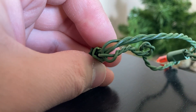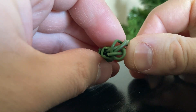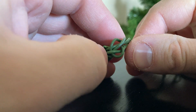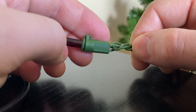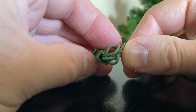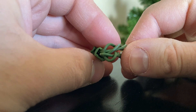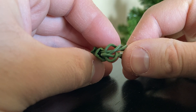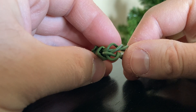I critiqued this string in this manner and said this is a bad design. This is a very common design — the majority of strings I've worked with have this design that allows water to get in there. The problem is likely that over time when it rains, the water will get in and corrode the contacts, corrode the diode leads, or both — causing the bulb to stop working and in some cases the entire set to stop working.